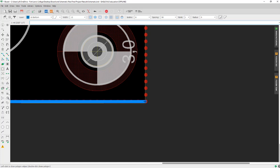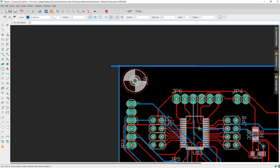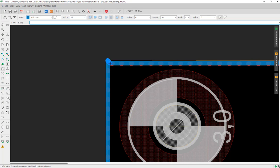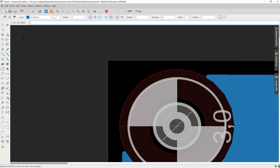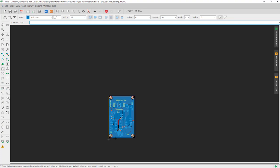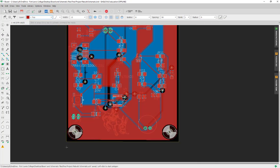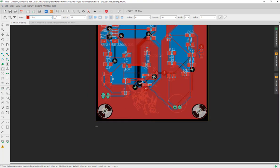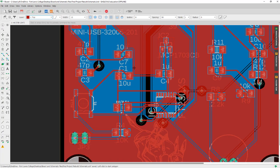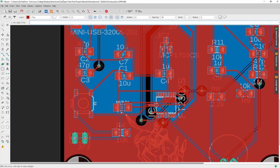Ideally, your polygon shouldn't have any empty areas in the middle, but I don't think I have time to do it for the scope of this class. Let's just, oh, it's not joining, okay, see? So you want to do this, join it, and connect the bottom pour copper to ground, and then do a rebuild. Okay? So you can see, luckily, you don't have too many empty areas, so that means most of the areas are covered by pour copper, which is able to give you a pretty solid ground and VCC. So it's not really routing a very thin trace through a long distance, which drops the voltage and causes issues. And don't forget to run a final DRC, see it's no errors, and then you're pretty much ready.